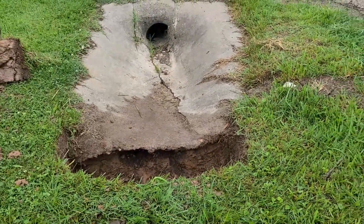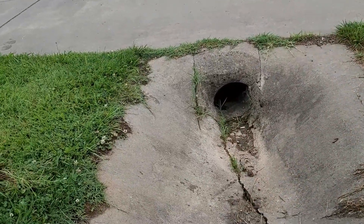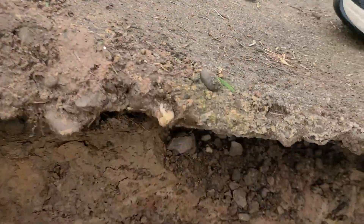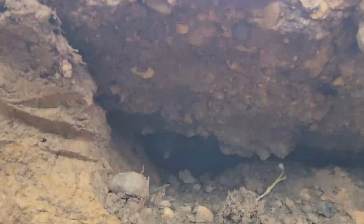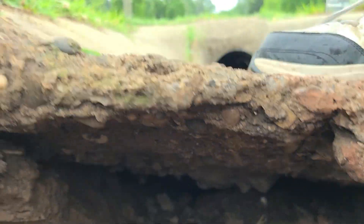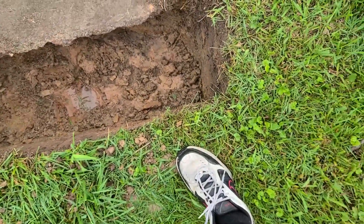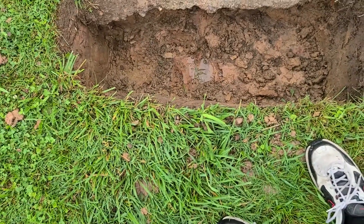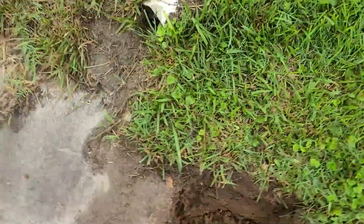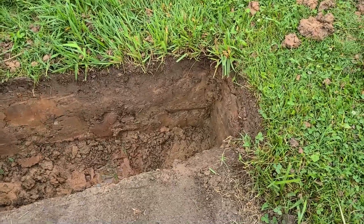As you can see, we dug out in front of this mess. I can get down in here and show you what's going on. You see down in here — there's a big cavern hole underneath here. We're gonna fill this with concrete and then we're gonna put about a foot and a half wall dam in front of it.